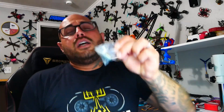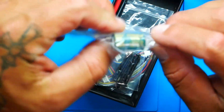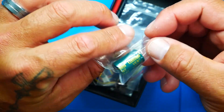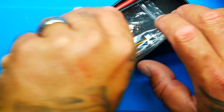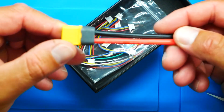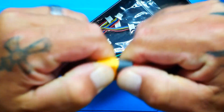We've got a 1500 microfarad capacitor — it's 35 volt, so it will handle your needs. That is a big capacitor. You've also got your mounting bolts — two, four, five — you've got an extra in case something goes wrong. And you've got your 12-gauge XT60 connector, and this is not the cheap one with heat shrink — this is the one with the actual connector.